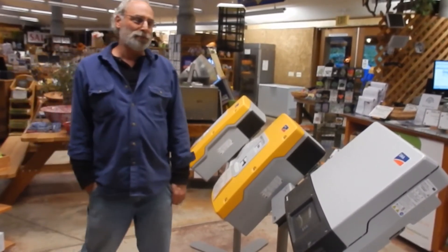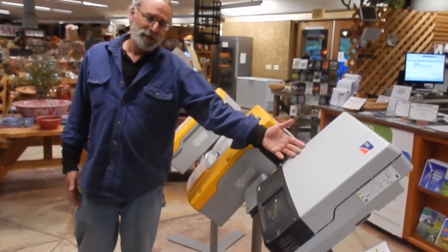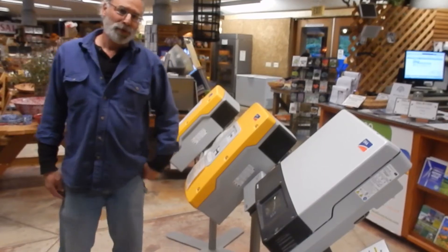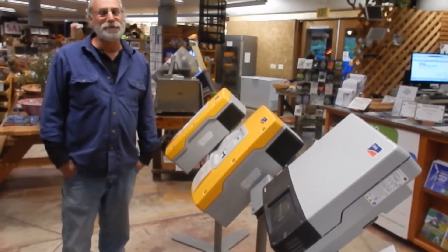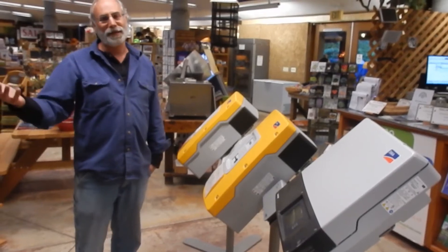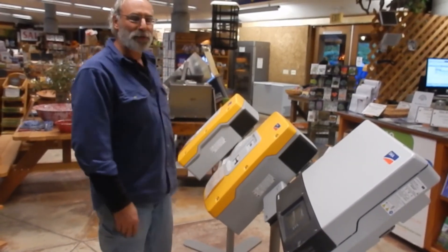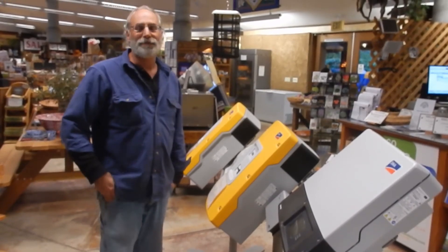Part of the beauty is that homes use alternating current, and these inverters produce alternating current. So we don't have to go through many steps — solar to a charge controller to a battery, back to an inverter to finally make alternating current. Instead, we go solar to a string inverter and now we're making alternating current in the off-grid world.